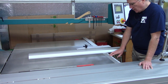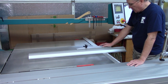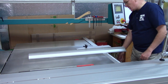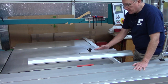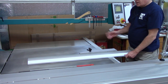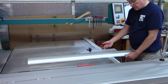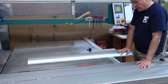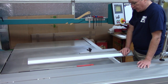As far as scales go, pretty much every saw I've seen has an analog scale, which is essentially a tape-type measure attached to the fence assembly. You can position the fence — usually by a knob — lock it in place, and wherever your fence line is, that's your setting. Some fences have a micro adjust or fine adjust: you get it close and then tweak it. This particular saw doesn't have that; its micro adjust is really the handle on the other end, which I'll talk about separately.